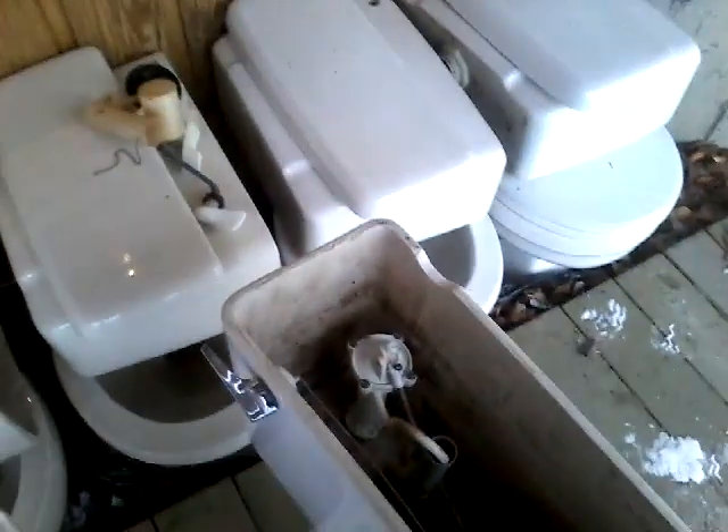Speaking of original — I've got this lever right here, and this flush valve. These things are actually branded Crane on the side. For a flapper it's a Fluidmaster — I'll take it off later, so not the original Crane flapper. But you can literally feel 'Crane' printed on the side of the flush valve. I haven't been able to get it off. I noticed that crack — I'm pretty sure that was already here. Someone fastened the flush valve or the original bolts too tight and it cracked.